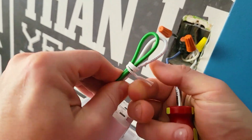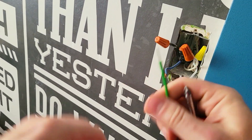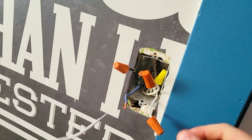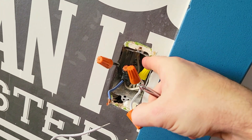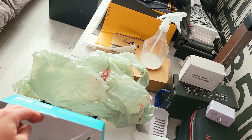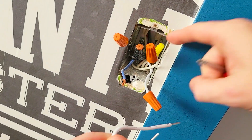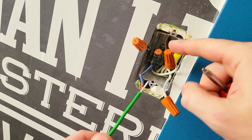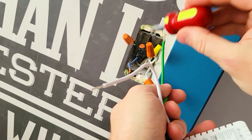Now let's grab our brand new switch. This one has only two cables — the white, which is our neutral. So the neutral gets connected in here. We're going to remove this extension cable since the previous switch didn't have any cables pre-attached. Then we're going to attach this one first, then take the ground and remove this one — there's no need for it. We're actually going to take the ground and directly attach it to the can at the very back.